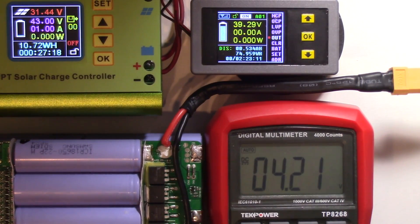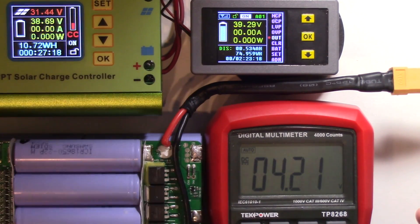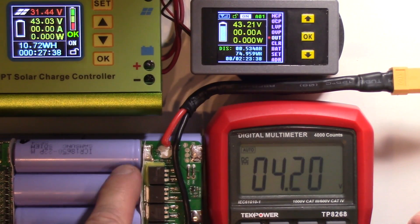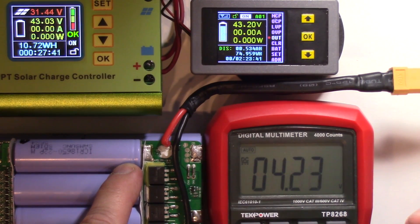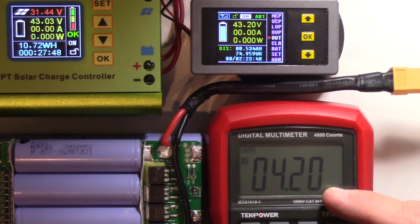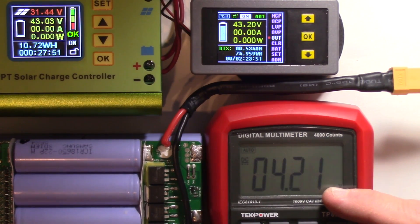Here's the result: I charged it up to 43 volts. It didn't seem to make much difference after a certain point. You can see it just spikes straight up to 43 volts and zero amps, which means the cutoff circuit on the BMS has turned it off and is no longer taking a charge. The cutoff point looks to be almost exactly 4.21 or 4.20 volts — you'll see it bouncing back and forth.